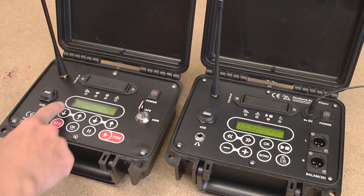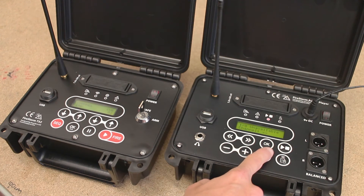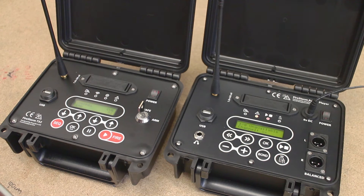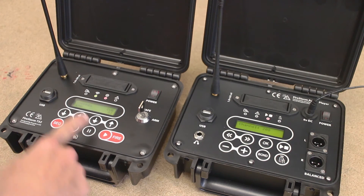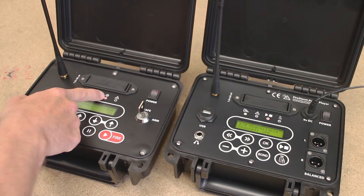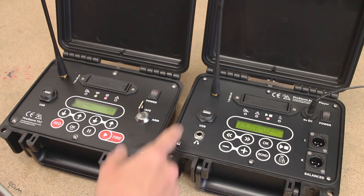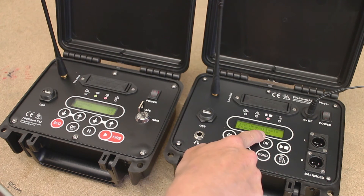In this example let's go ahead and bond it to Channel 200. You select Channel 200 on the TX2 and then simply hold the Bond button on the audio player. The Bond light will come on, you release the Bond button, and then just like any other firing module in the system you press and release the fire button. You'll see that we now have a signal light which is green and a continuity light which is red in this case because we don't have an audio track loaded onto the unit. If we did have an audio track loaded via USB stick, this light would also be green. Notice also that the screen now shows you the channel that the audio player has bonded to — in this case Channel 200.